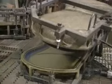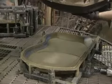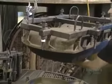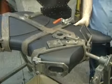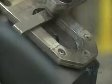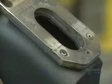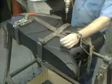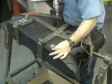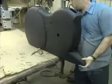The mold cover is lifted off and the plastic piece is unmolded. Gloves must be worn since the piece and the mold are still very hot. Here they fabricate a mechanism cover for a stationary bicycle. It's held in place by a cutting pattern and openings are cut with a pneumatic tool. Holes are made with a drill. The casing is now completed.